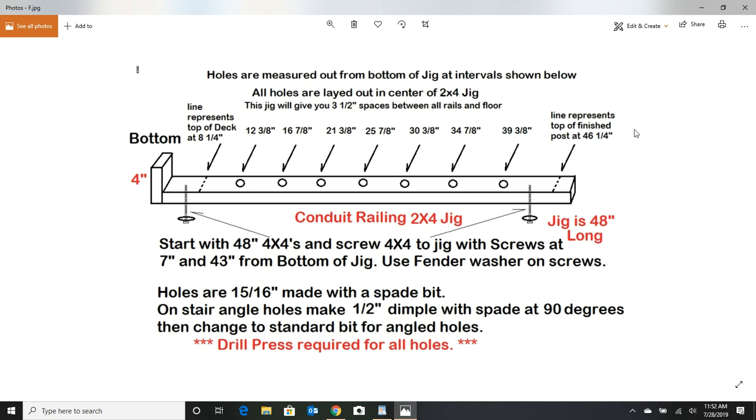Let's start with the jigs. This is your main jig — you're going to make this so you can drill holes in all your 4x4s. It's got all the math for you. This is laid out so when your deck railings are finished you end up with three-and-a-half-inch spacing. In New York, where I'm from, you cannot have a deck with spaces larger than four inches, so this keeps you a half inch within code. Check code in your area, but chances are you'll be safe.